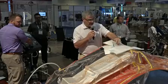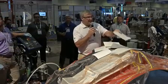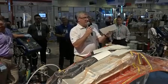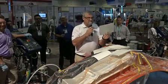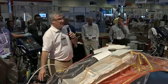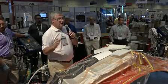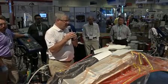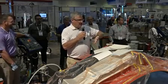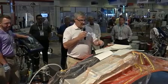Our SORIC material is stitched into this multi-layer fabric, and it's also available by itself. Typically this thin SORIC material is used on the sides of the hull where you want really good cosmetics and a good smooth surface finish. It does a great job of hiding any print from heavy glass material or different core materials.